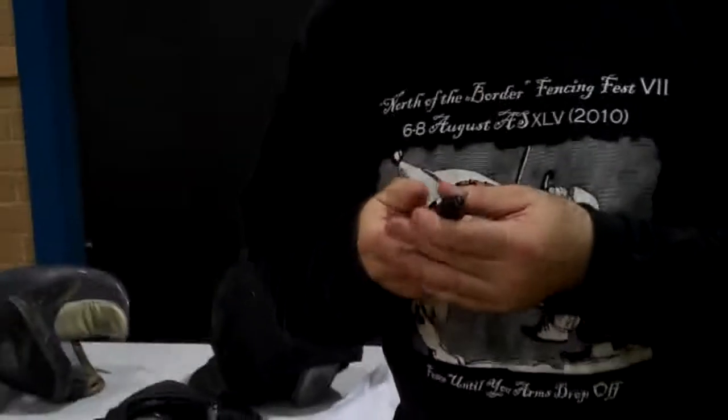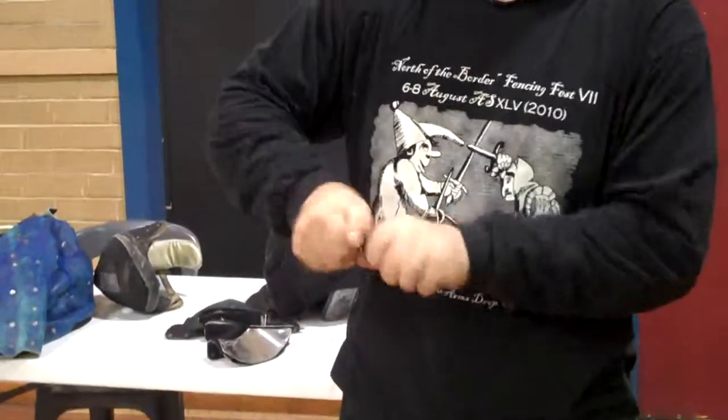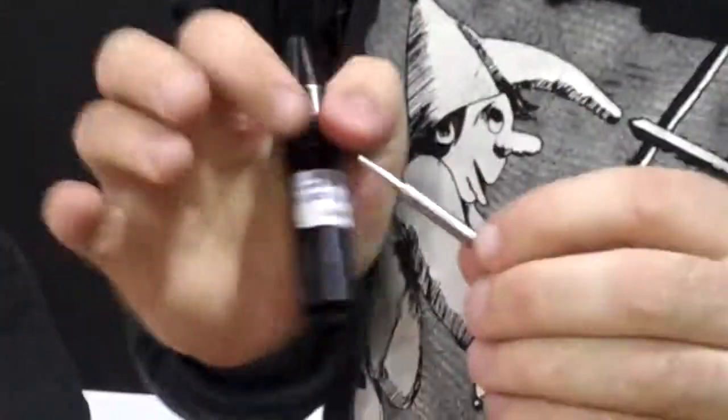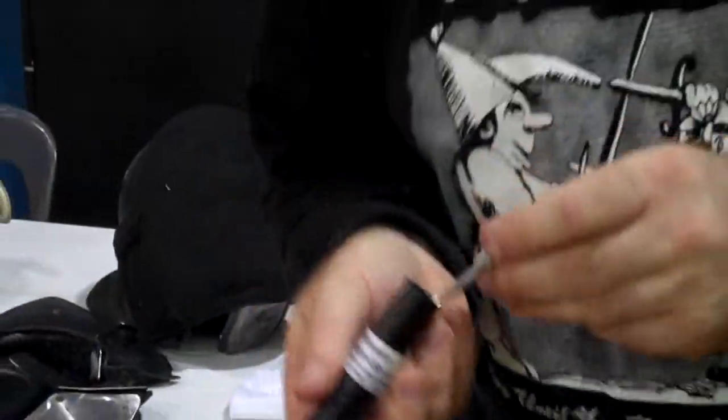If it fails, or it doesn't seem to be acting too well, what you do is you pull this apart, right, a spring, cap. Dean, you might want to come in closer, right, and you've got the pin there. Right, if you're having any problems, probably get some pipe cleaners, clean inside there. You'd probably give this a little bit of a hand polish, make sure that you clean it off all grit, and this is when it becomes really easy.